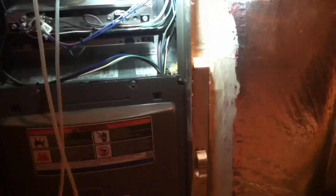Alright guys, today we got a Lennox furnace. It's going to be an ML180 series, a 70,000 BTU three-ton drive furnace, and we are doing a static pressure test. Two-year-old system. Here's your evaporator coil, supply plenum, flex duct in the attic, here's your returns. I just changed the filter to a 16 by 25 by 1 pleated filter.